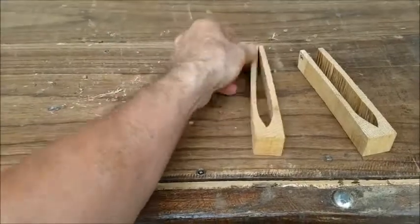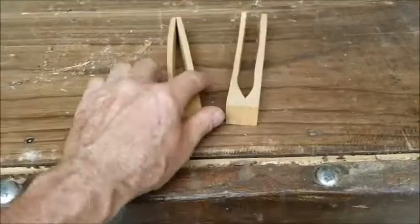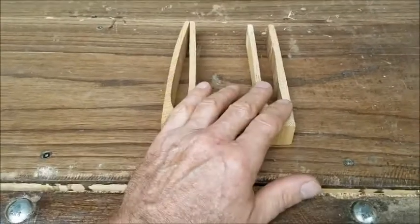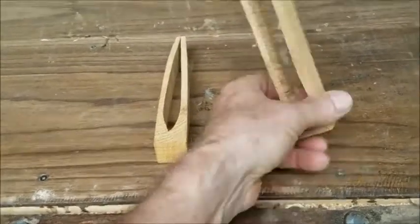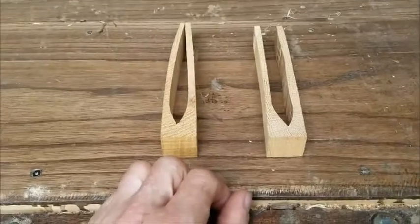By the conditioning process, when you're introducing high-temperature steam at a large volume to saturate the outer fibers of the board — in my kiln with my size load it takes about 30 minutes — then I cut a sample board, go to my bandsaw, cut it, and it comes out even like that.